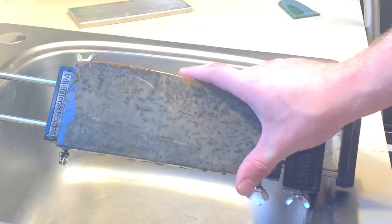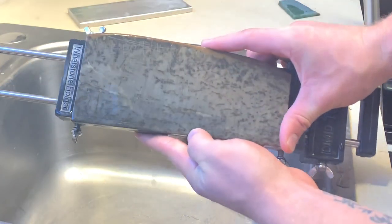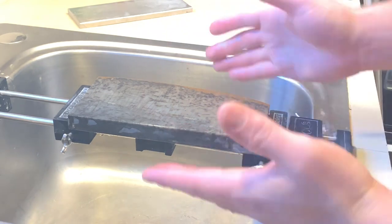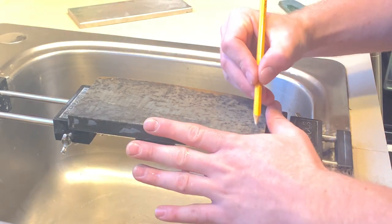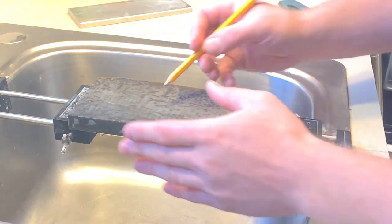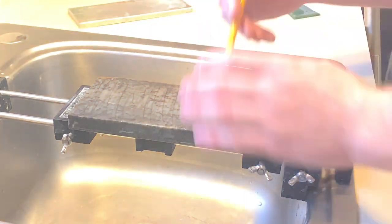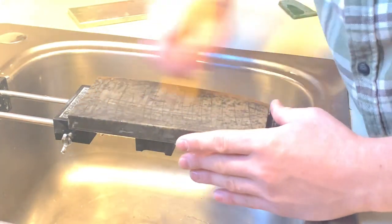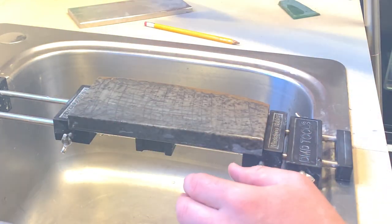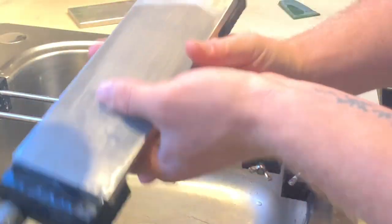What I've done is I've gridded the stone with pencil and that lets me clearly see the surface. A lot of guys get a ruler out and spend all this time doing really perfect grid lines — don't waste your time doing that. Just put your hand on it like this and go across the stone. Good enough — it's got most corners touched with pencil. You save yourself that five minutes of drawing your pretty pencil grid.